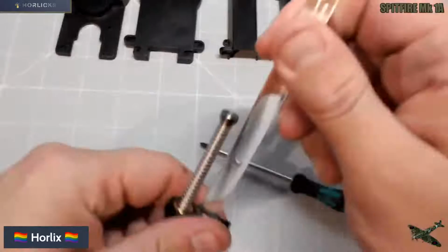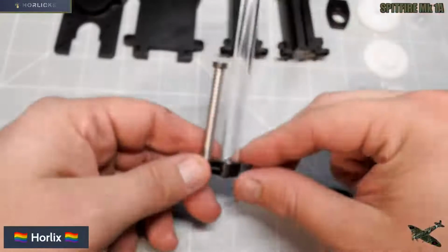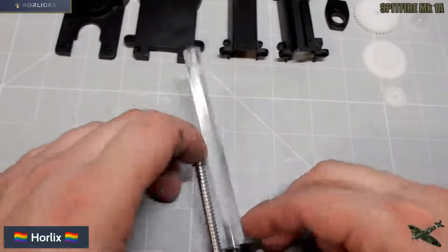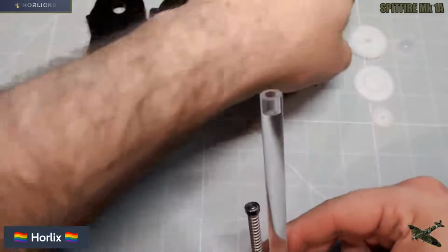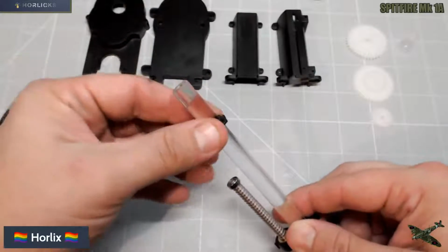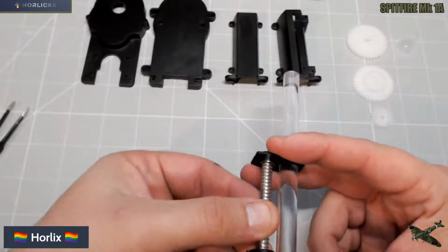Okay. I think I'm happy with that. Jolly good. So step 5 then is take part 8105 and fit the open hole over the top of the end of the acrylic rod 8111. Slide part 8105 down the pole so that the bearing 8113 fits into the closed socket in part 8105 as shown below.